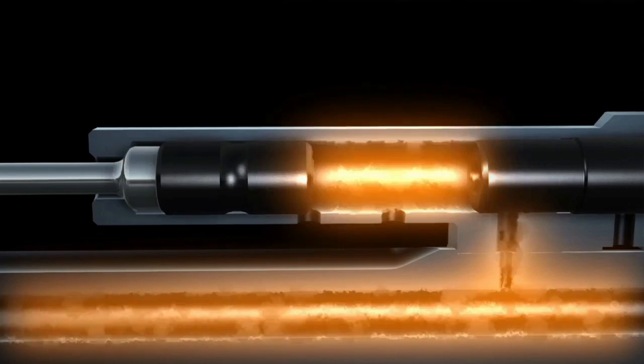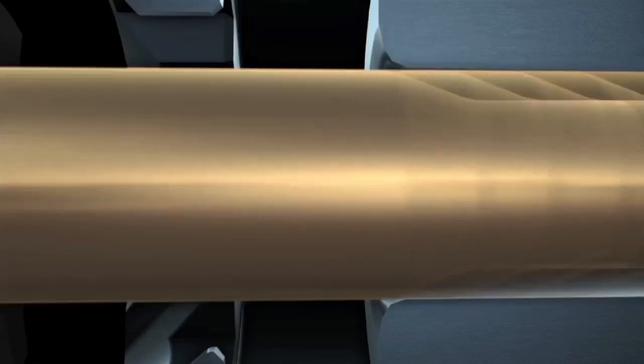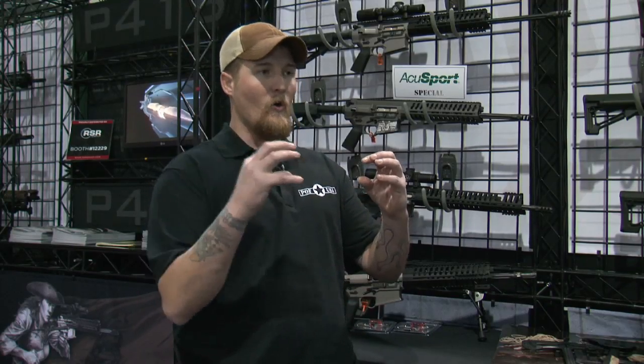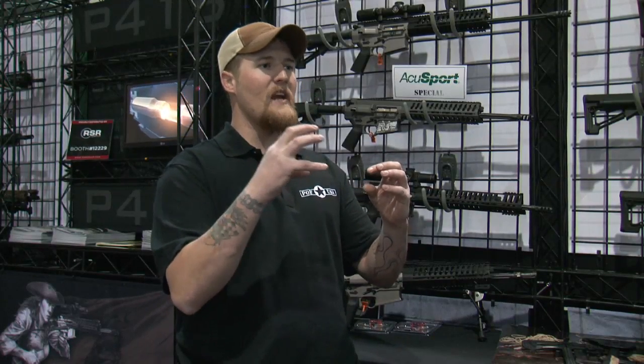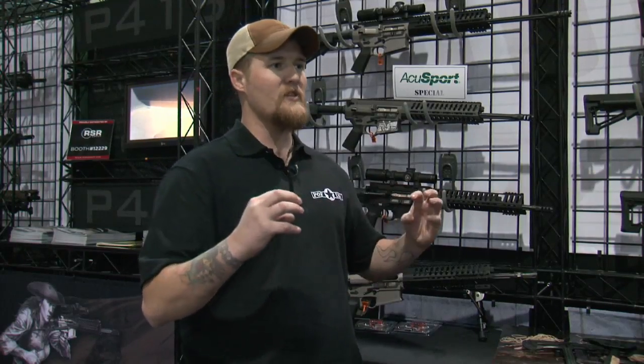What we've done is we've got some canals, if you will, inside the actual neck — just around the neck — so the brass is 100% reloadable. It doesn't deform the brass, and it redirects that pressure from only interior to around some of the exterior. So it equalizes the pressure, helps the brass break the seal, and it floats out.